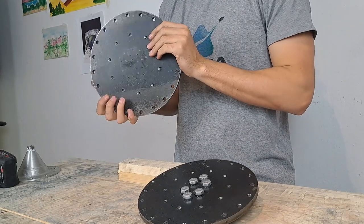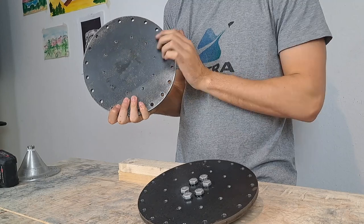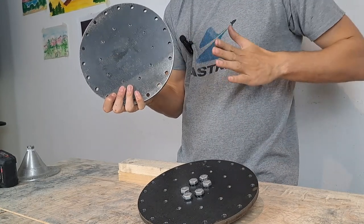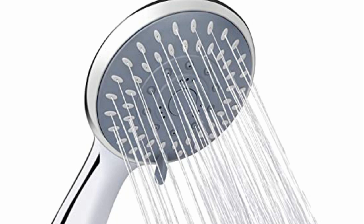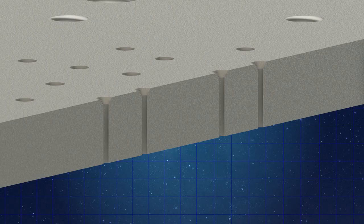Basically we have to break apart all of those liquid globules into the smallest pieces possible so they have the best opportunity to mix with the fuel inside the combustion chamber. One way to do this is simply to drill a bunch of little tiny holes into your injector plate — the process of making them really small allows the propellants to atomize as they come out the other end. This style of injector is called a shower head injector. By making the holes really small, you are setting a limit to how big the drops can be as they go into the combustion chamber. With this style of injector, the smaller the better.